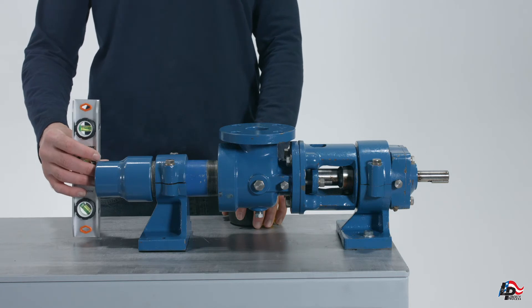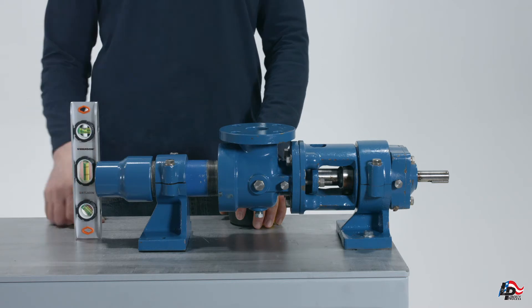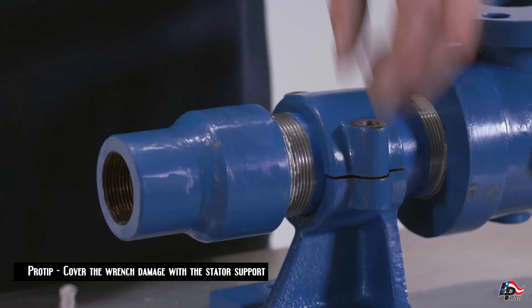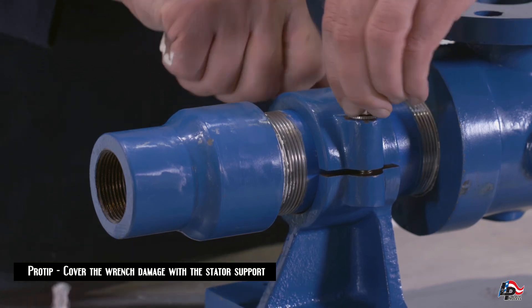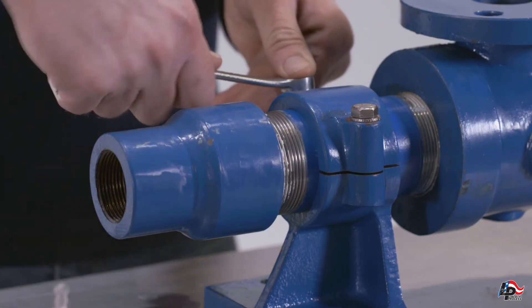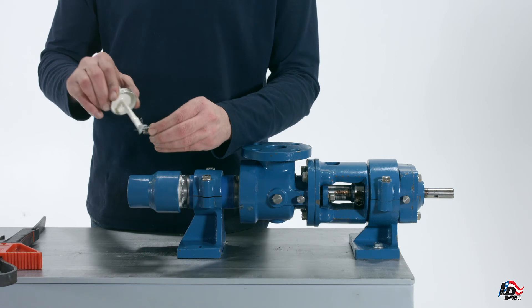Using a tape measure, make sure the length from the center of the pump casing flange to the end of the pump adapter is the recommended distance for your specific stage LL3 pump. You can find all recommended lengths on your LL3 pump drawing by going to the knowledge base section of our website at www.LibertyProcess.com and downloading the appropriate manuals. Add the top of the stator support and tighten the two mounting bolts by hand. Using a tape measure, make sure the length from the end of the adapter to the anchor hole in the stator support is the recommended distance for your specific stage LL3 pump. Tighten the two mounting bolts using a 9-16 inch wrench. Add the pump drain plug into the bottom of the pump casing and use thread sealer to seal the threads to prevent leakage during use.